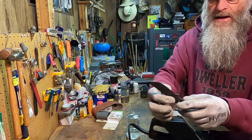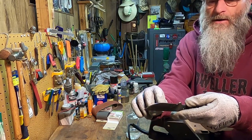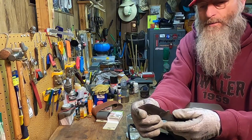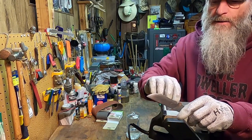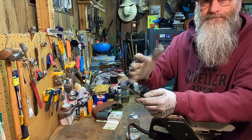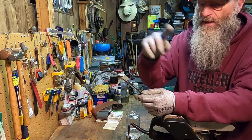Still straight as an arrow. I got no warpage. When I cut this, I ground this down to a knife edge almost. I talked to my heat treat guy. He said, no, you're going to crack that baby. So I took a file and I got it about the thickness of a dime maybe, and put that back on here, grind us down to close to our edge. So then we can do the actual sharpening when that day comes.